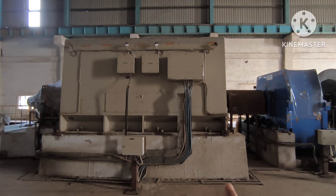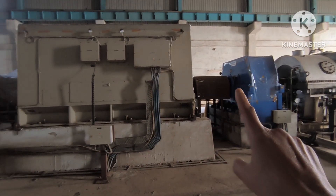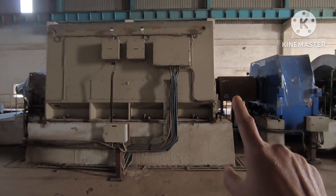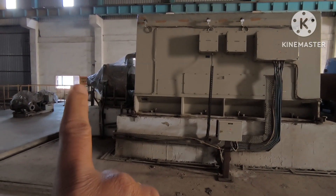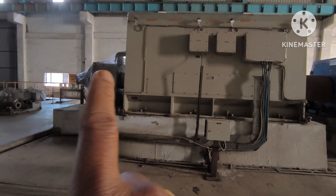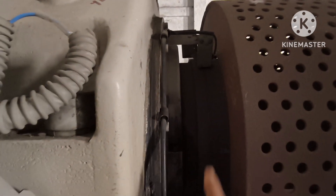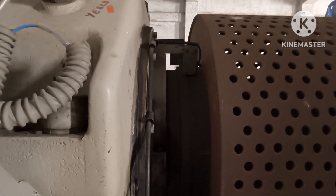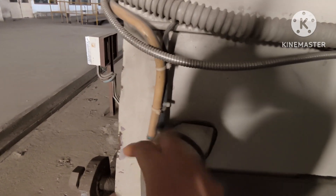The generator D-side is coupled with the turbine. On the outer part of the rotor shaft you will find one carbon brush, and this is the ND side. On the ND side you will find the exciter and PMG; at the extreme end is the slip ring with a carbon brush used for rotor earth fault protection. The grounding of the outer rotor portion is done here, and a feedback cable from this ground is taken to the rotor earth fault relay XR1 at the U2 terminal.